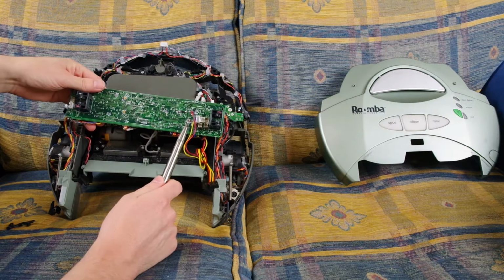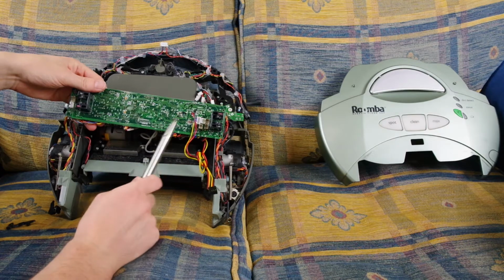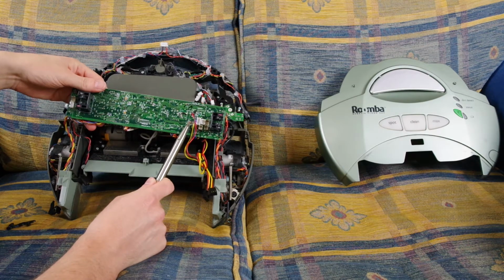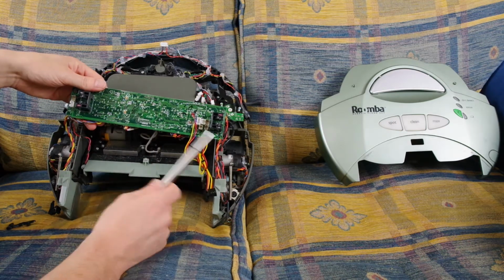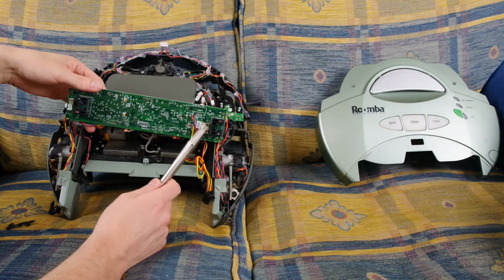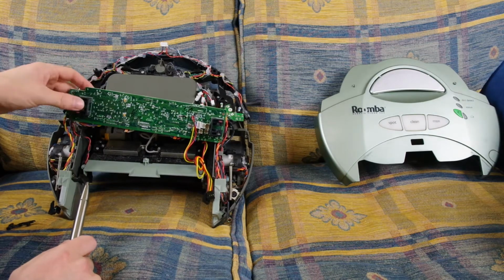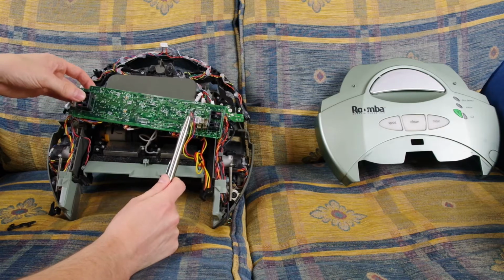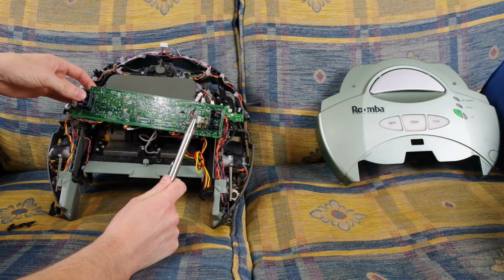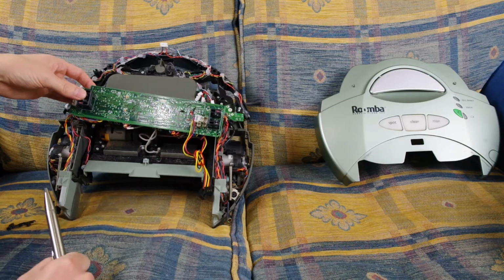This one here, what they don't tell you is the stuff on this side of the board is glued on. I think the reason they glued it on was because they wanted to send all this through a solder bath once. So anything on this side of the board, in order to stop it falling off, was glued on, or in the case of these pieces, these two beam breakers are in fact screwed in. So what I did is tried to desolder the MOSFET at position U2, didn't realize it was glued on, pulled it off the board, ripped all the traces with it, and the surface of the board, and I was just like, oh, bum,